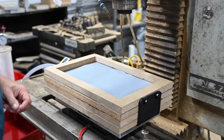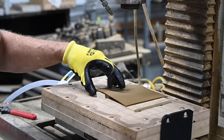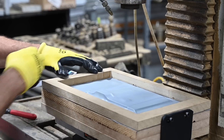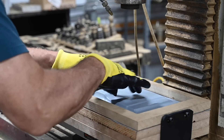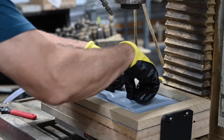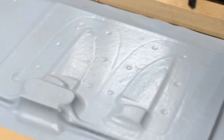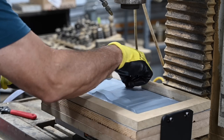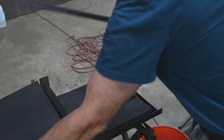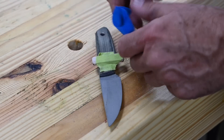If you're not familiar with how vacuum tables work for making kydex sheaths or holsters: you have a flat surface — a table connected to a vacuum source. The form is put on that table — it could be the knife itself or whatever. Then a piece of hot, floppy thermoplastic like kydex or boltron is laid over the top of the form. A top which has a thin flexible silicone membrane is laid over that, and the air is evacuated from the space under the membrane, sucking the membrane down around your form so that it molds the mushy kydex exactly to that form. Once it cools and hardens, the kydex sheath or holster is removed and assembled — holes are drilled, the outline of the sheath is cut out, then the whole thing is assembled with belt clips and all that. A lot can go wrong when you use a press; the idea here is to take all the guesswork out as well as a lot of the upfront fiddling with molds and heat guns.